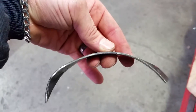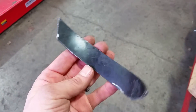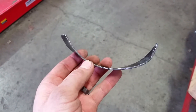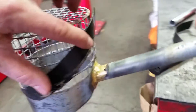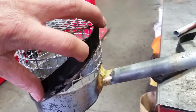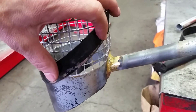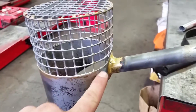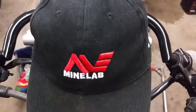I had to make two of those pieces — one for each side — not a lot of fun to make. As you can see, it's not just bent but twisted. It fits on here in this manner; you'll see the purpose of it later. I want to give it the ability to stand on this and push the scoop down into the ground, with a brace from here going to the handle to make it a little stronger so it's not relying just on this.